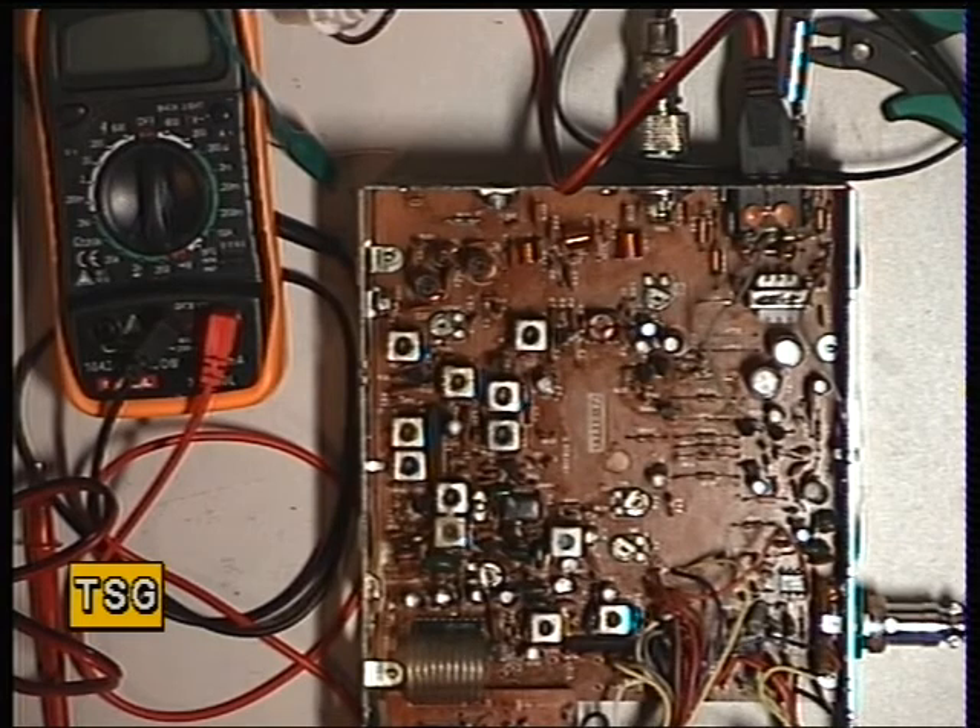That now completes the set — it's been repaired. The problem was with the phase lock loop, because the nut was missing from the channel selector, which had snapped some of the wiring. We've now aligned the transmitter, aligned the receiver, and checked the VCO. All it now needs is a loudspeaker, probably off a scrap AM set, and to put the radio back together and air test it. Thanks for watching — I hope you found that interesting.